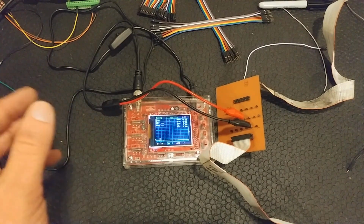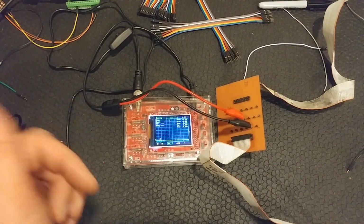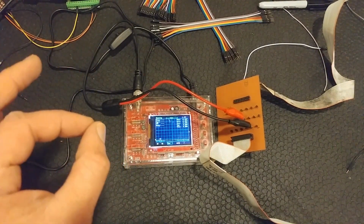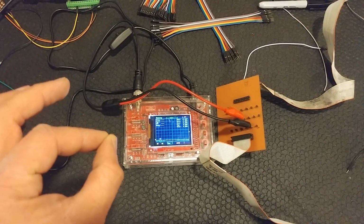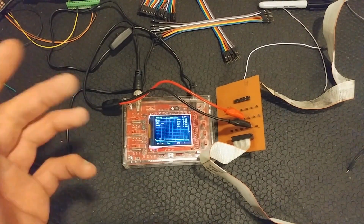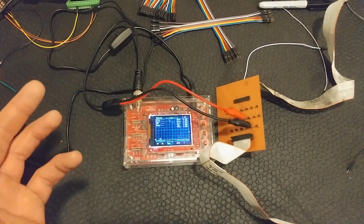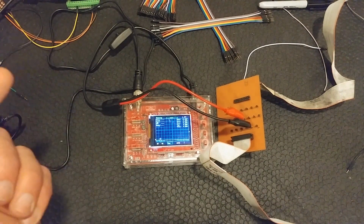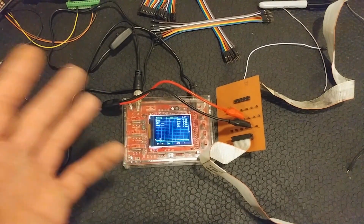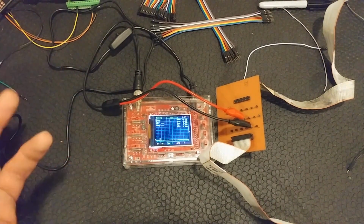Working across pin by pin, I did find 2 others that seem related to the lift motor. One changed state when we pressed the button to go up, and the other changed state for going down. I'm not sure exactly if that's a feedback or a control signal, but it's something to keep in mind for later on when I try doing that workbench with the lift motors built in. I've also found a few others where, honestly, I have no clue. I hit the buttons on the control board and don't see the signals, or see a high voltage that I can't read anything out of, or maybe just noise in some of them. Things you really don't know, but you kind of stumble through and just see what you can figure out.